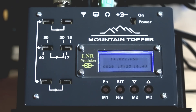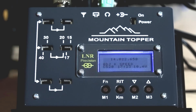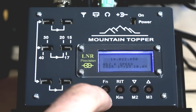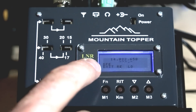Let me show the configuration menu. On the old radio you held down function and stepped through config options — that still works, but it's faster now. Press function once and you immediately get keyer speed adjustment. The display says 'Adjust K Speed' and the down arrow decreases the WPM — 16, 15, 14 — instead of having to hold until you hear 'S'. Holding function steps through further menu options: direct frequency entry is next.